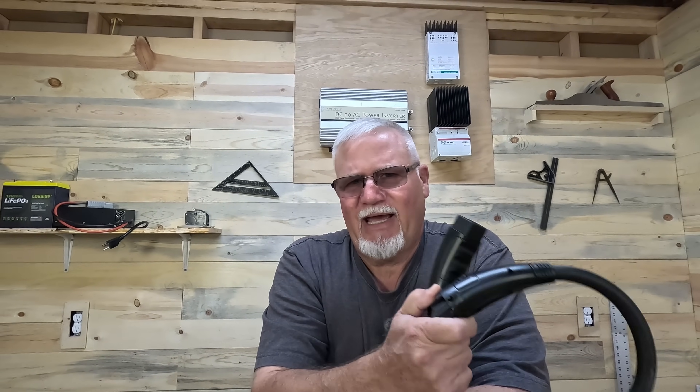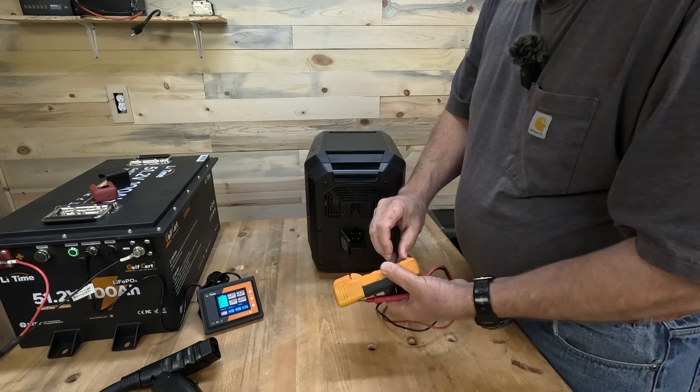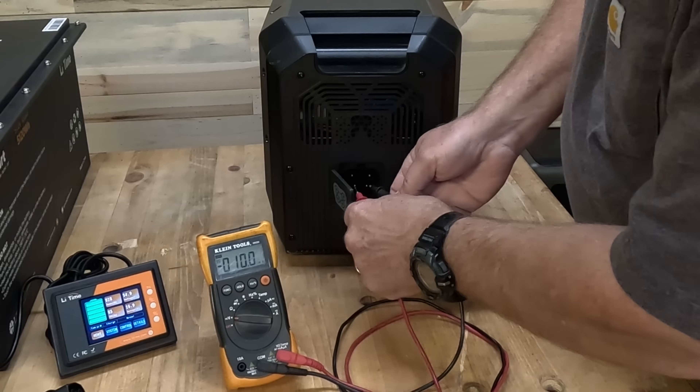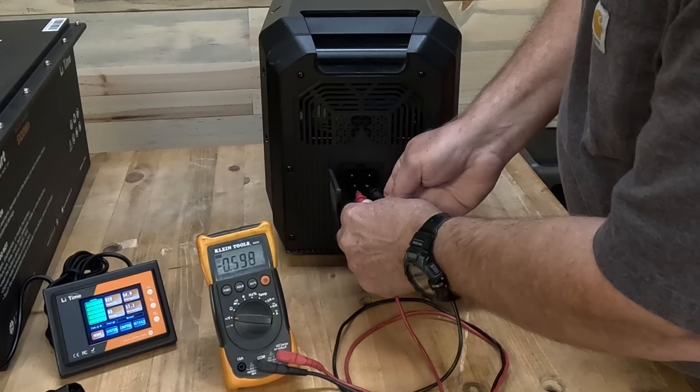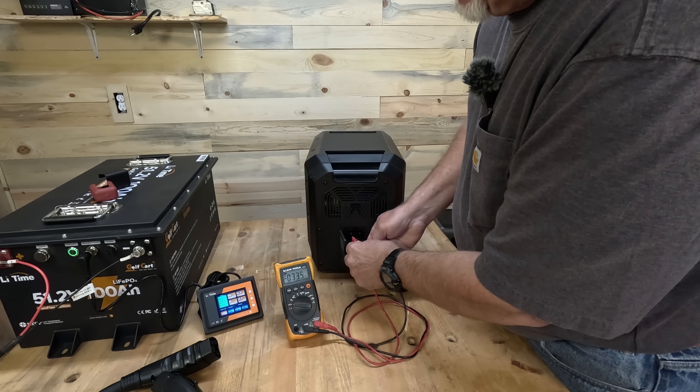We're going to cut it apart. But first, I need to check a couple things — I need to make sure that the unit actually has voltage at the connection that you plug this into, because that's step number one. If some crazy connections in the center of this thing turn things on and off, it wouldn't work without figuring out a way to jump those. So the first step is going to be grabbing a multimeter, plugging it in, and seeing if I have voltage. Do I have any voltage right here at the battery connections for the external battery? There's none there — nothing across there. So basically, it's currently dead.